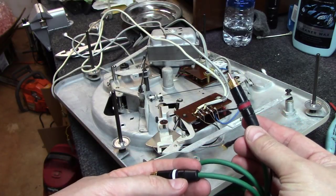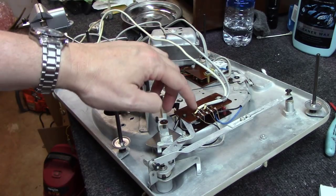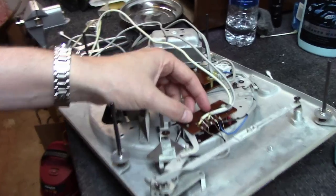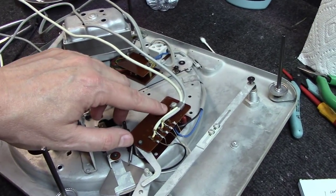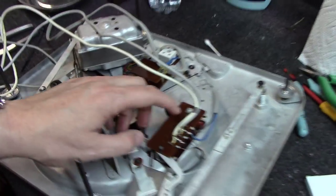So at that point now, we know we can unsolder this, because we know the left channel will be white and the right channel will be red here. And we'll just wire it up the same way. Center conductor, outer conductor. And then there'll be a last one that goes all the way over here, if you can see, to a little ground lug right here. And that will be our cable shield.